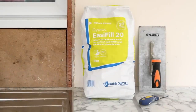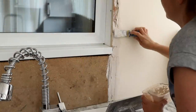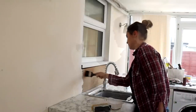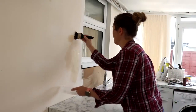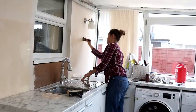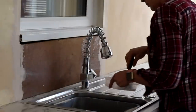The first thing I had to do was patch up this old doorway which is now a window, but I've decided to save that bit for the next video because it's highly unlikely someone needs this as part of their tiling project. So I'm fast forwarding to where it's all skimmed — it's generally a good idea to patch any uneven surfaces so you can start tiling straight away on a roughly level surface. And now I'm coating the painted wall and the wooden section with a PVA solution. I know some people think this is a bad idea but the adhesive I used was amazing and they're not going anywhere.